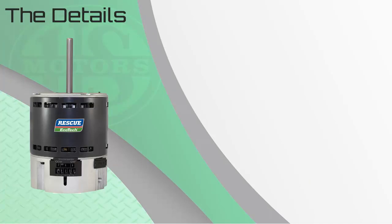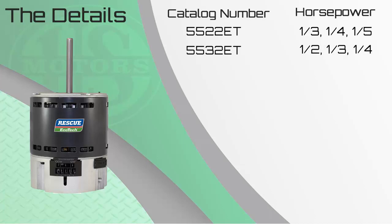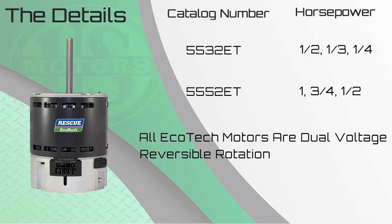The Rescue EcoTech is available in 4 multi-horsepower model numbers: 5522 ET, 1/3 to 1/5 horsepower; 5532 ET, 1/2 to 1/4; 5542 ET, 3/4 to 1/3; and lastly 5552 ET, 1 horsepower down to 1/2 horsepower. All of these models are dual voltage and reversible, making them an excellent truck stock motor. Just stocking the 5552 and the 5532, you have covered the horsepower range from 1 horse all the way down to 1/4 horse.